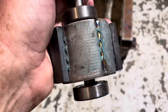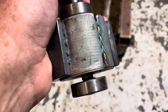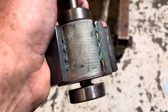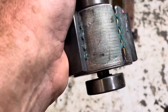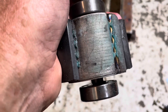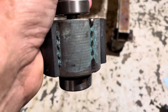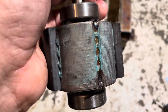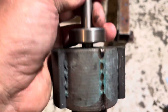The other day my air conditioner blower stopped working as well as it should — it was still blowing but not very fast, and it started making a metallic scraping noise. I went into the crawlspace and took out the fan, which was an endeavor by itself. I got the entire fan scroll out, then detached the motor from the fan housing.